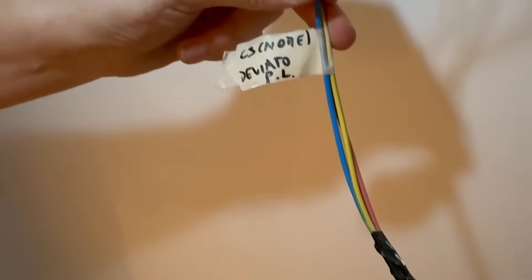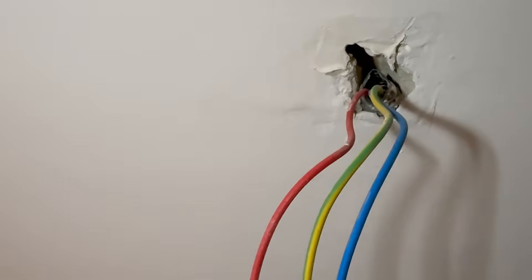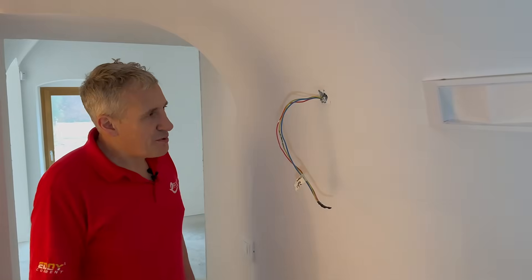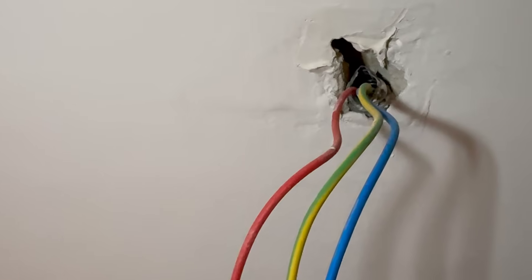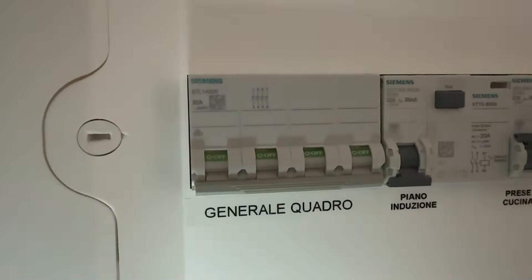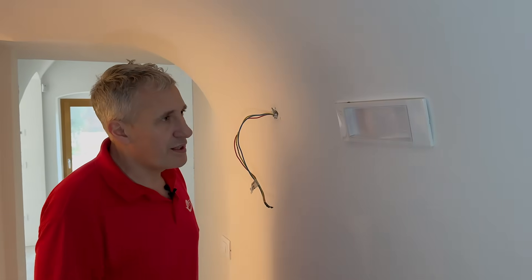But then when I look at these lights waiting for the final fitting, I see a red wire. I thought we were supposed to be harmonised across Europe — we'd adopted the colours we have now: brown, grey, and black for phase. And yet we see red. British colours making a comeback! Also interesting: the emergency lighting has also been added. I think that's a great idea for residential properties in case you're tripping a breaker or have a power cut.